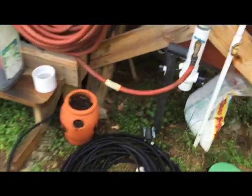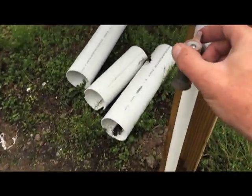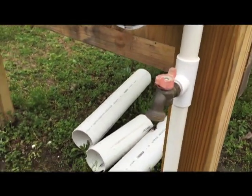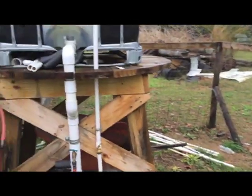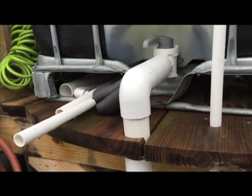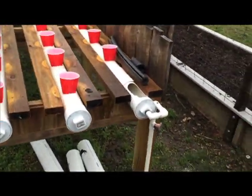I'll flush it - let me turn my main water back on and flush that pipe a little bit. It's reassembled and I've put in a hose bib so I can completely drain the system out and get the trapped water. I would have thought it would have gravitated down beyond that. Maybe I need to put some filtration on the water tank - you can see there is some buildup near the bottom. I flush it from time to time but maybe that's not sufficient. I'm going to let this glue set up for a few minutes and then turn it back on and see what happens.